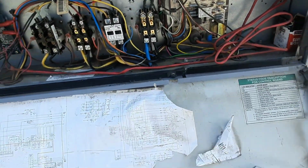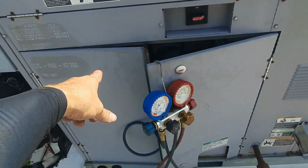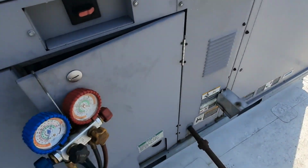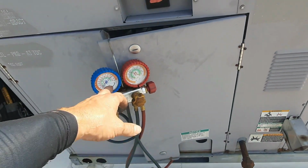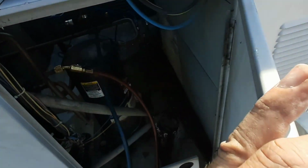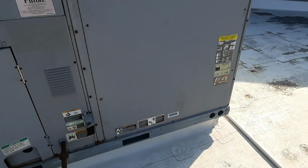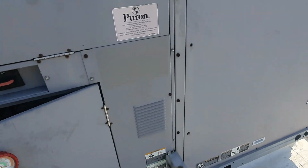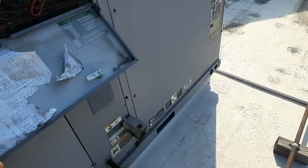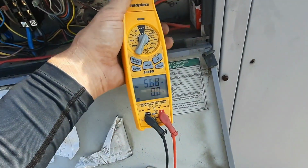So we got a new contactor. Compressor ought to be good. I'm connected to stage 2 that was running. That was stage 2 there. We got some stage 1 pulled in. We'll give it a few minutes to cycle. I don't know why the Carriers do that when you cycle them on. Compressors like to run for a second. We'll let them cycle on normally. There was just a little bit of ice on the evaporator, which should melt off.